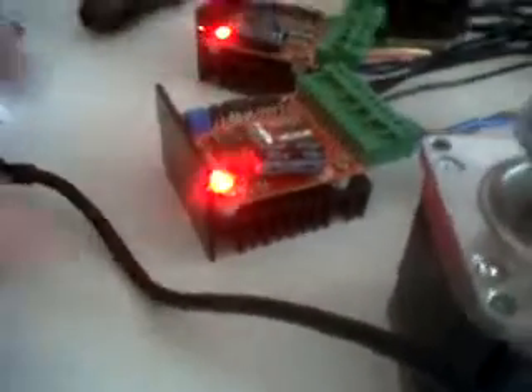The comparison of these drivers at £12 each with a TB6600 chip over the ones with a 6560 chip is: these can only go up to 24 volts. If they're a fiver or a tenner and you're waiting 30 days for them to come from China, you may as well just ditch them and go with these. They've got a nicer, fatter heat sink — look at the comparison. That's the heat sink on them, and that's the big old heat sink on these ones. They've got a foot on them as well, plus they've got plug-in connectors, so you can stand them up.